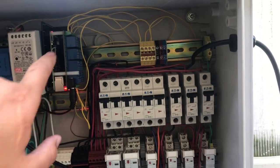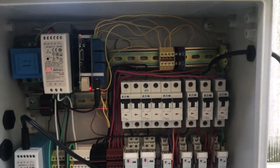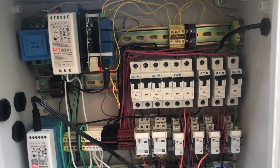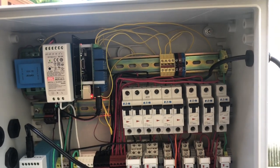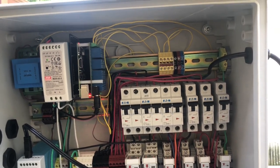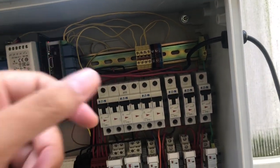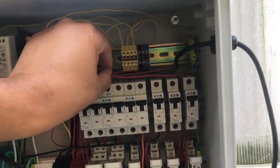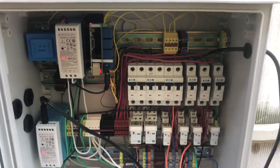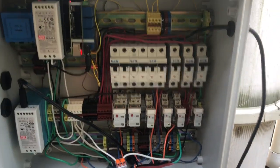You can use the ADCs for things like temperature or, in my case, pressure. The transducer spits out a voltage and you do a little math to convert it into PSI or temperature. They also have little hall sensors that go around the hot leg and tell you how much current is running through that line — that gets plugged in and displayed as well.